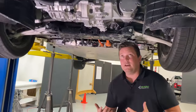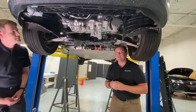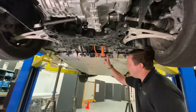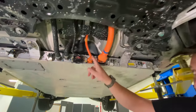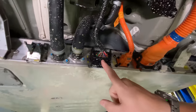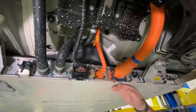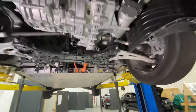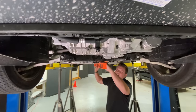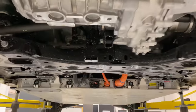Sandy covered the Kia Niro, and this is essentially identical on the underbody, so we're going to dig in a little deeper and show some things Sandy didn't point out. First thing we notice here is your high voltage output from the battery — this is headed to the inverter and this is going to the high voltage AC compressor. You have your low voltage here for your controls and your thermal in and out. What we noticed is this is lower on the ground plane than the cradle. I've grabbed a level here to show this — it's about an inch lower.